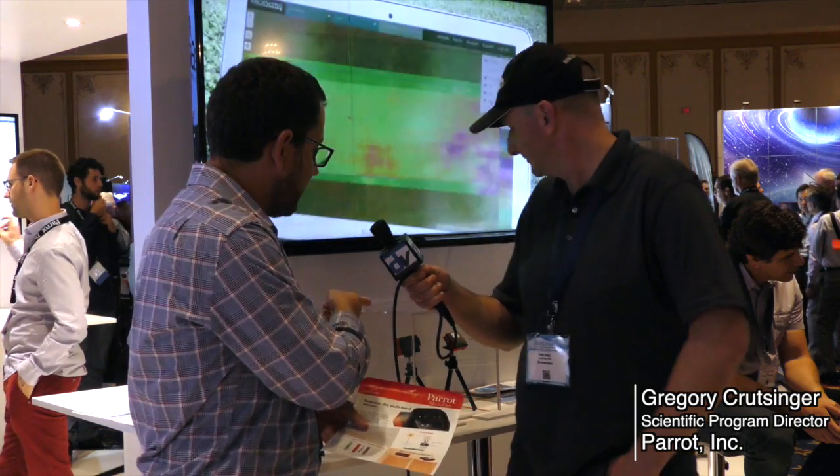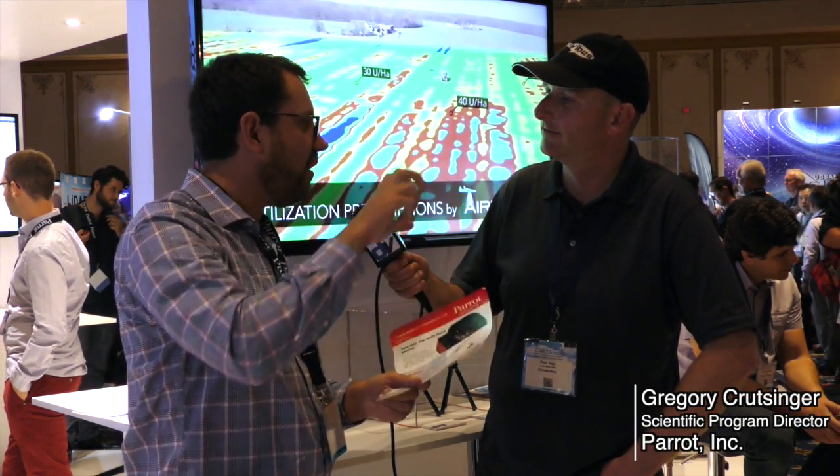So what data does it give you? There are four TIFF files that come off the red, green, red edge, or near infrared bands, and a 16 megapixel JPEG that's your color photo. It'll also give you light data. There's an external GPS that comes along with the sensor, and that will geotag your photos as well as trigger the camera. So it doesn't have to be integrated into the autopilot of the drone — the GPS will trigger it. And there's also an IMU for all the directional pointing of the camera. So, a lot of data.